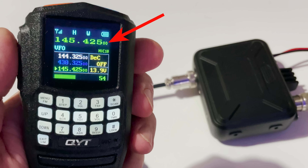This is particularly useful if you have repeaters stored with a name. On the very top line of the display we can see some kind of signal meter. There's also an H which indicates we're in high power mode and a W which indicates I am in wide FM. After making this QSO I realized I should have actually been in FM narrow — if I was in FM narrow it would show an N instead of a W.